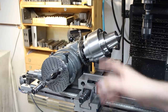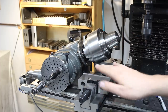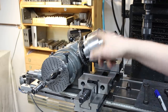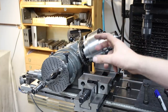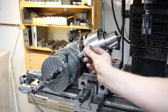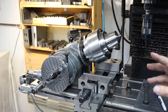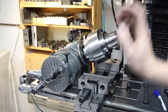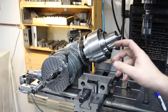Here is the dividing head mounted off to the side — with large chucks the vise interferes, but at an angle that works. Otherwise I have to pull the vise off. The front tapered bearing, once locked, is crazy rigid. I think that's it for now — I've been talking too long about this dividing head. I hope you enjoyed it and the machining content was interesting. Thank you all for watching and see you next time.